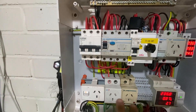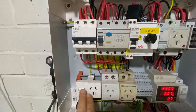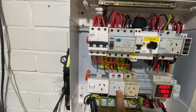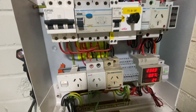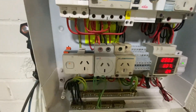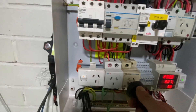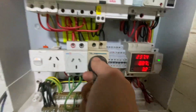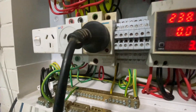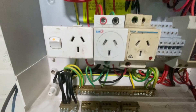I probably should tell you about isolation first. Because this is my test board, these conductors go out through these ones, so once I trip this RCD it's going to turn off these devices — and that's just from memory. We probably need to get ourselves a device to test for dead. I'll just plug something in because this should light up — see the neon indicator here? Now the neon indicator — it's got a device in it, so she's dead. It hurts me to say I ruined a perfectly good board, but let's go prove a point.